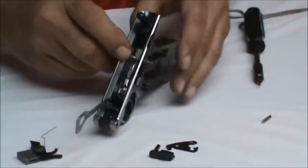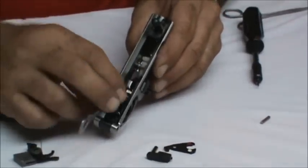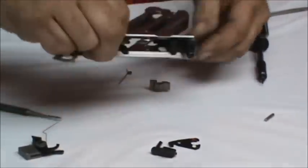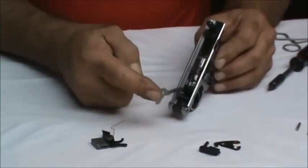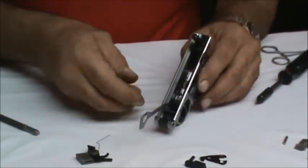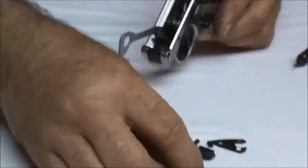The pin is out. We're going to turn the frame upside down and dump out the sear and the original sear spring. Next we have to take out the spring and plunger in the center of your trigger, which activates your disconnector bar. We're going to remove those — just turn it upside down and drop them out.